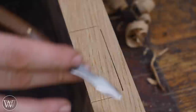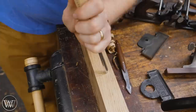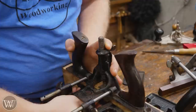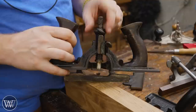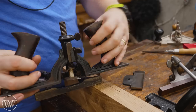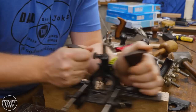Often the corners were square, so I could come in with a chisel and extend these lines and square them off. But as we know, most hinges now are rounded. So you could find a gouge that matches your round, put it on there, and with a few quick taps you've got a rounded corner that matches your hinge. Now in comes the 171. I can put my knife on the line and loosen up these and slide this fence in to give me the exact placement so that my cutter won't go over the line. Then there's this doohickey up here and I can rotate it to raise and lower the cutter. I can set it for just a light pass right there and lock this down. There's a second screw that locks this foot in place so it doesn't rotate easily.